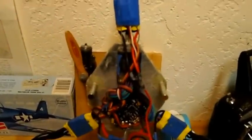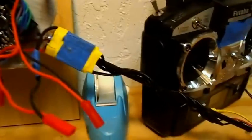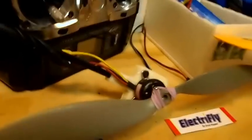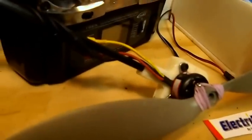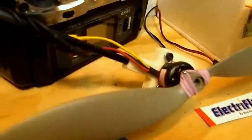What's made differently is it's not all made of aluminum — only the center piece is made of aluminum, which is holding the KK blackboard and the receiver. The legs which hold the motor are made of carbon fiber. The motor mount I made on the MakerBot from a part I designed on SketchUp, especially made for these motors.